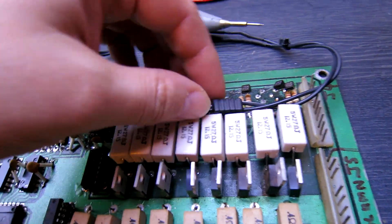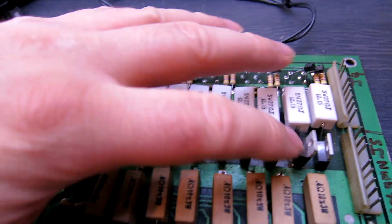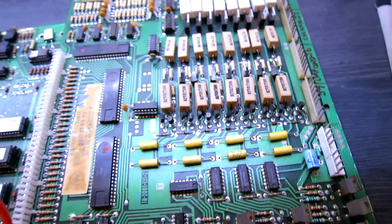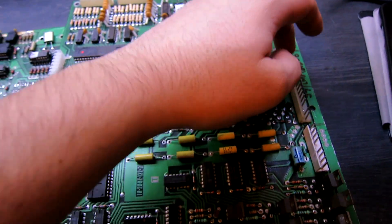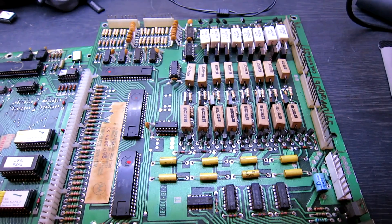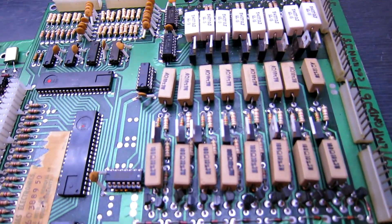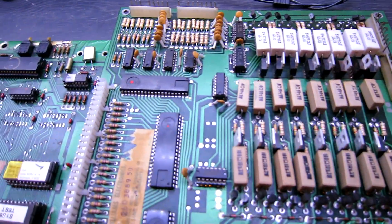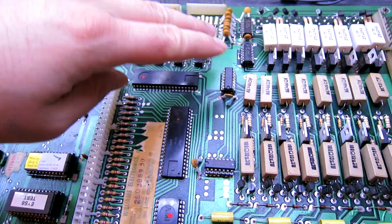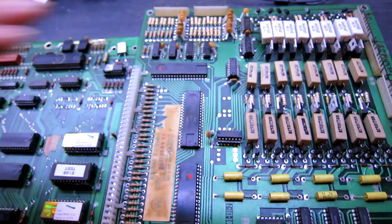Additionally, the lamp columns and drives are all dead. You have to basically hook up additional power to here and here - that's your ground there, then your 5 volt. But it's not getting any activity at all on the columns or rows. So I'm going to trace that back through the circuitry. We've had some ICs replaced here, so we need to check that work and make sure it's been done properly, then check back towards the PIA.